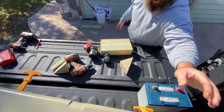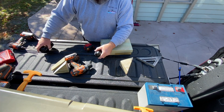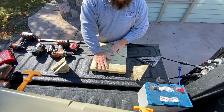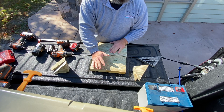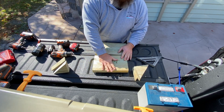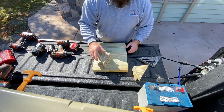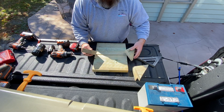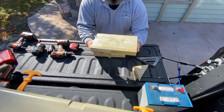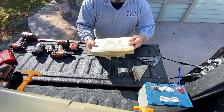Alright guys, this is the second part of my build for my new power supply. These are the two pieces I cut 12 inches long — it's two-by-eight dimensional lumber, so it's one and a half inches thick by seven and a half inches wide. My shelf needs to be 15 inches by 12 inches. I also made these little triangle pieces to mount on the bottom to add support for that 50-amp power supply.